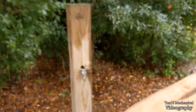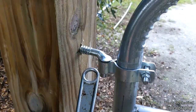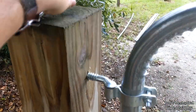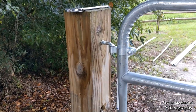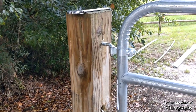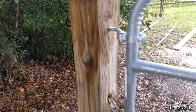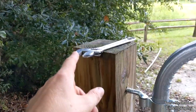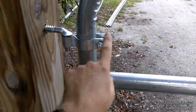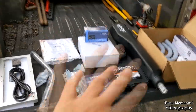A quick tip with these hinge pins: get an adjustable wrench and use the open lug on the end to turn these, or you can use a small piece of 3/4-inch pipe, or a box-end wrench. The nice part about using an adjustable wrench is once you've got everything set up and you put the gate on and realize you forgot to grab the ratchet, you've got an adjustable wrench sitting right there on top of the post to tighten this.